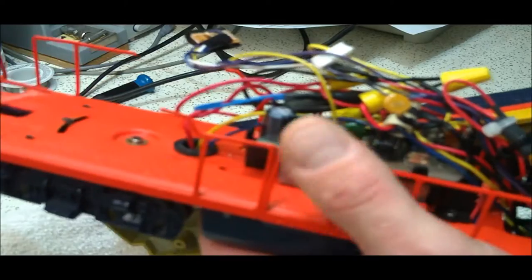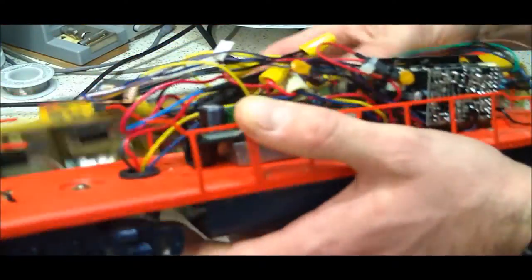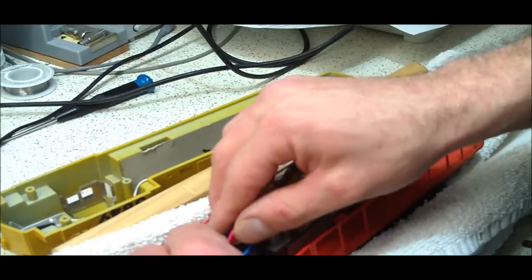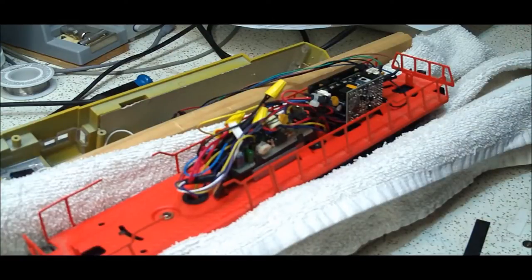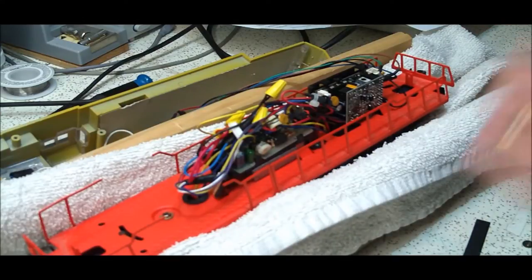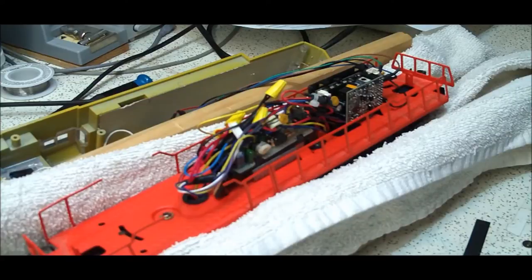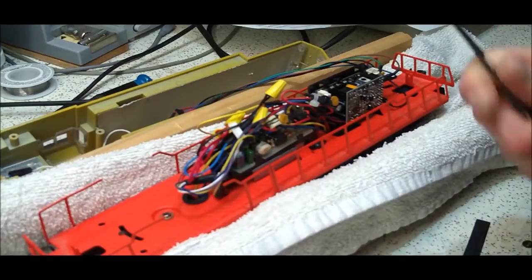That actually works now. Unfortunately I don't think my horn board sounds exactly like the factory one did, so if you're interested in doing that you might just want to pick up the RailSounds board now and get it over with. This is kind of like the prerequisite to the video — watch as much as you want, it's about an hour long. I also got a whistle tender to work with that board and needed some pretty complex circuits with two transistors and some diodes — I'll show that in another video.